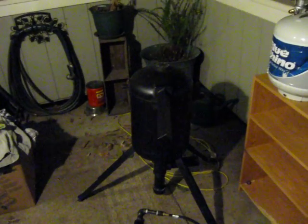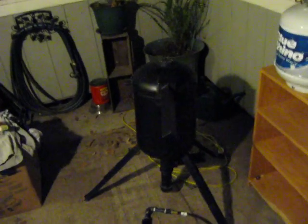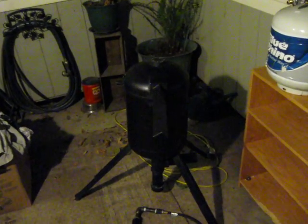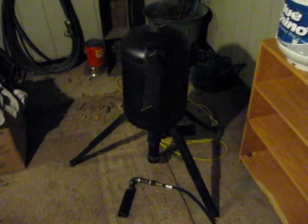This is my metal smelter. The main body is made from an old obsolete propane container, the 30-pound variety. I've basically separated it so it has a top that opens up. The exhaust has a removable piece so you can actually see into it when the fire is burning and check in there and throw more ingots in the crucible.